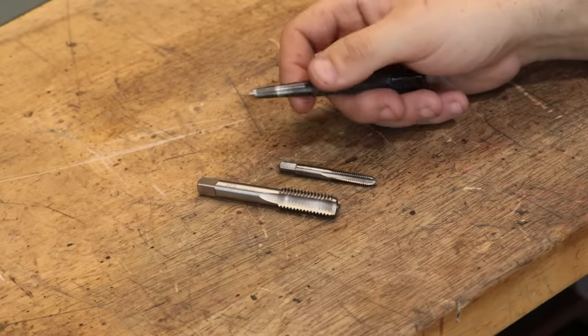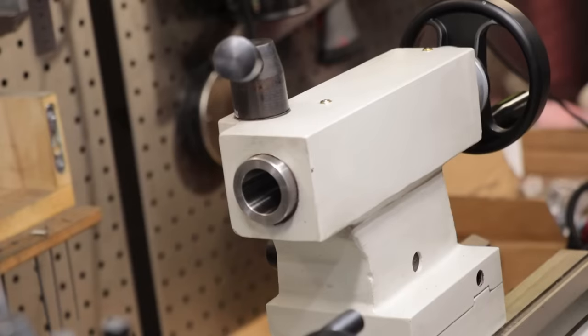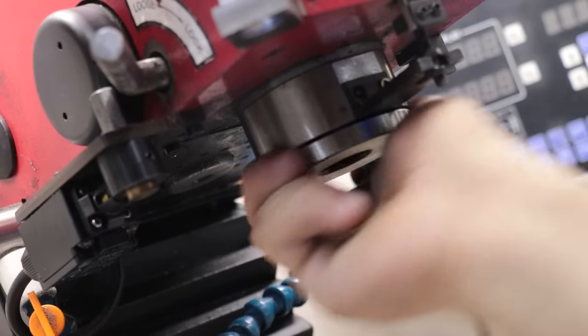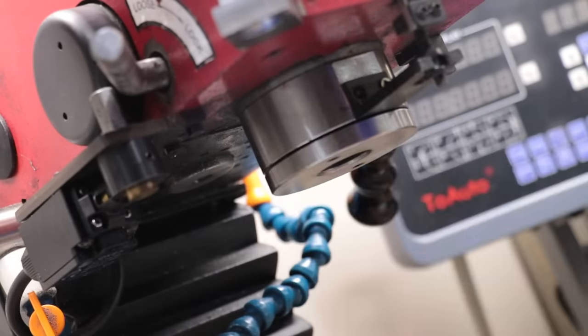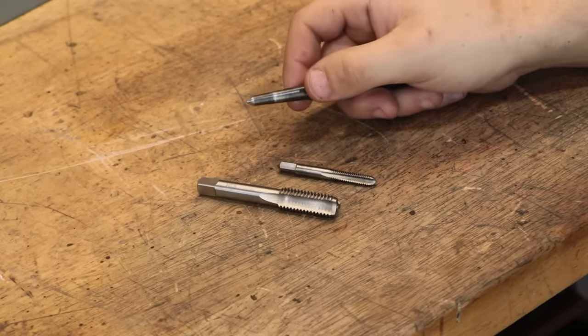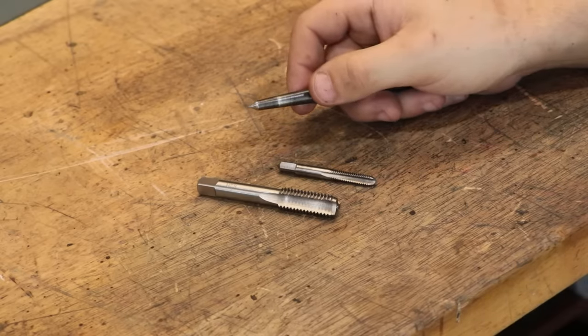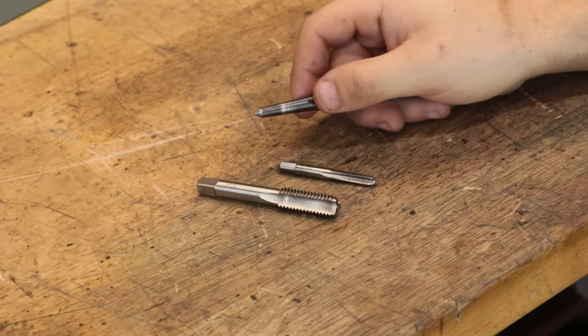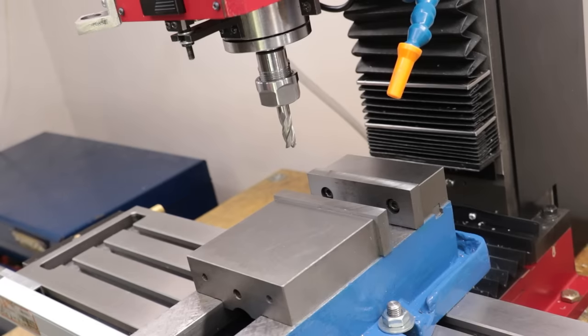As for the method of chucking, it's going to be entirely up to you. Both my lathe and my milling machine use a number three Morse taper, so I'm going to shape the main body around holding it in that sort of setup. You may prefer to hold it in a drill chuck and opt for a straight shank, or you can combine the two with both a taper and a straight shank. For me, I don't really have the room for a Jacobs chuck and a tap follower, so a Morse taper design should be a lot more compact and better suit my setup.